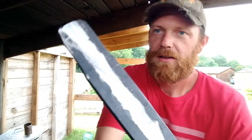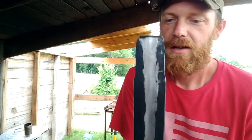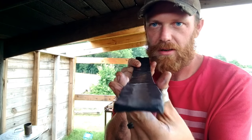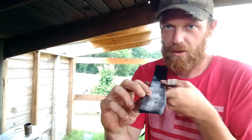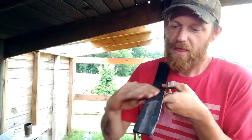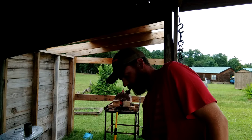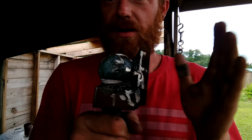It guided that line and gave me a nice clean line down the center, nice and straight, and that helped guide my contact wheel. Look at that — the contact wheel goes down in there and cleans it up just fine. Once we're done — this is just a sample piece, not the sword — we can go back and find the edges again. We'll grind our fuller in first, then do our edges, and that'll clean up this line on our fuller as well as true the edges up. I think this bad boy's going to work perfectly.